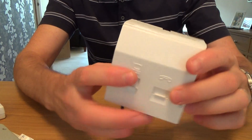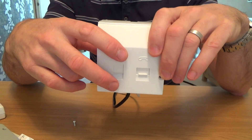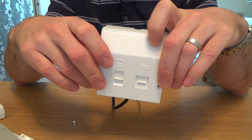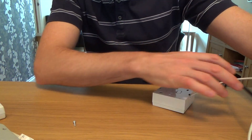On more recent ADSL faceplates — for the last few years — they all have that A and B provision, but not the older versions. So just double-check when buying an ADSL faceplate: if you do want to hardwire the ADSL signal to another room, confirm it has the A and B at the back. You can always ask the seller. If you want one of these ADSL faceplates, go to my eBay shop at mrtelephone.co.uk. Thanks a lot for watching this video — please subscribe to the channel for more how-to videos. Take care, bye now.